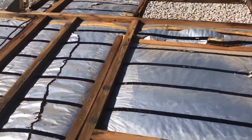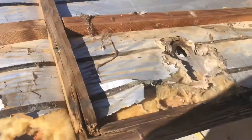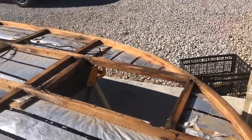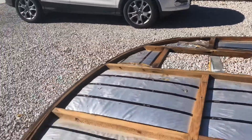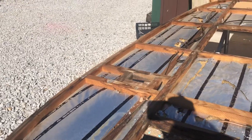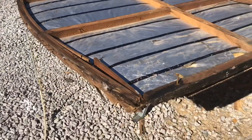It's pretty self-explanatory. The hard part is going to be starting here — this is the pieces of strips of wood that make this whole outer edge of this camper. I've got to take a bunch of them that are going to bend. I don't know how they got these three-eighths to bend like that. You could do this pretty easy, but once you get up here, that's just not going to happen. So we're going to use much thinner wood. We'll laminate them together with glue. It'll be very, very strong — probably even stronger than this because they didn't glue it.